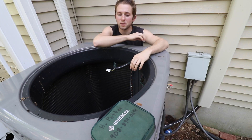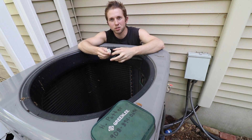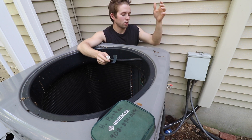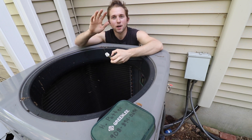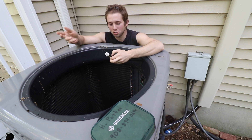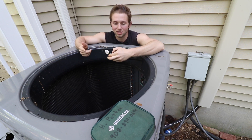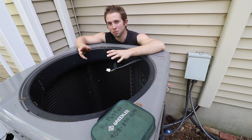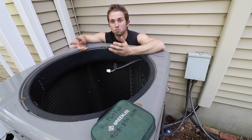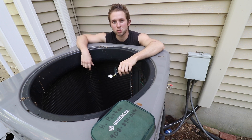After checking everything in the electrical access panel, I decided to get closer to the motor. I took off the motor cover, unplugged it, and started probing the connector. There are five wires connected from the connector to the motor: green is ground, blue is 120 AC, yellow is 120 AC, and brown and black are your signaling wires that instruct the motor to turn on. When I checked with my voltmeter I was getting proper current through all of them. So I figured it can only be the motor. I bought a new motor — it's in the garage. Let's switch over the fan shroud, put it back in the unit, and see if we can get this thing running.